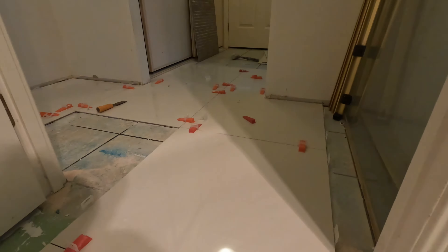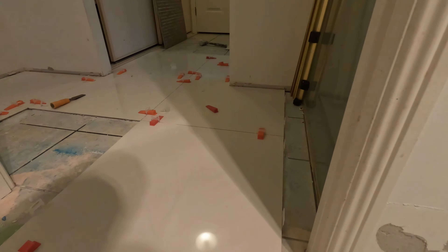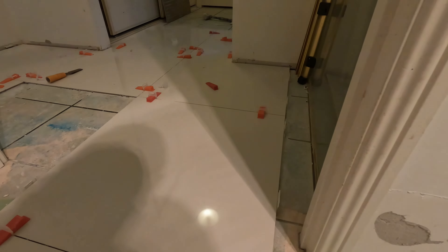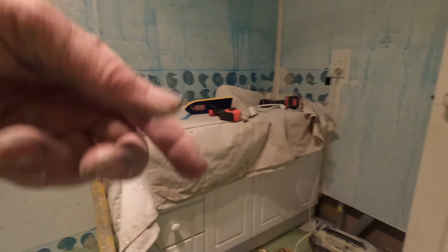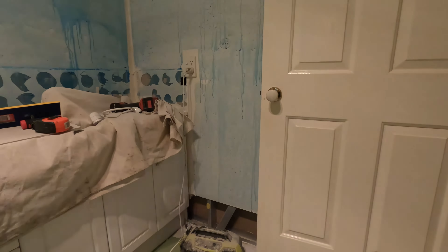With this here, instead of splitting the tile and putting a piece of aluminium across, what I have done is put a bead of silicon against the tile there. And with my next tile I'll put a bead of silicon against that tile, which will waterproof it all. If there is any water that comes out of the shower, it will not go out the door.